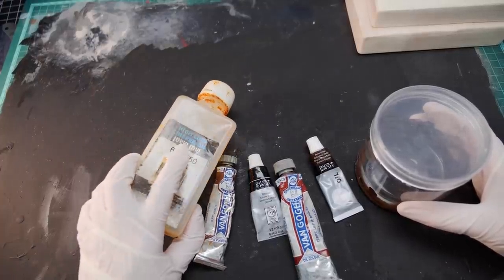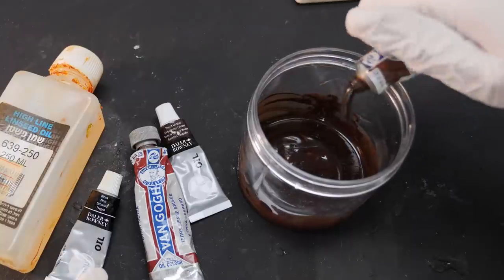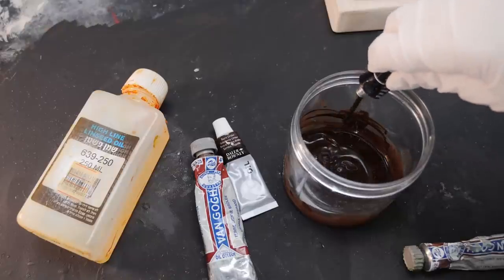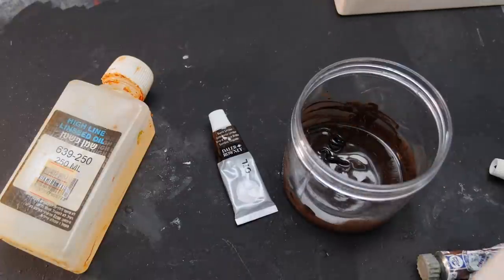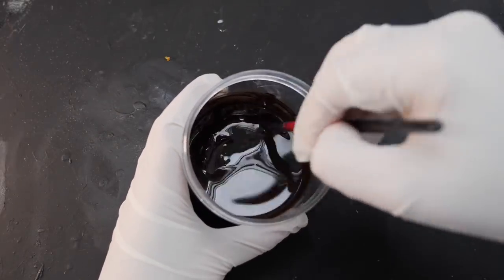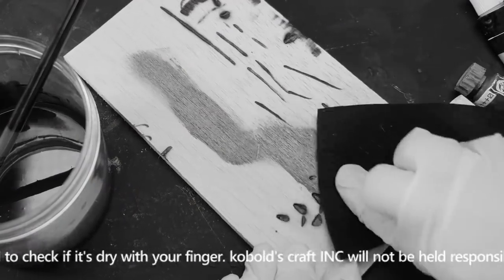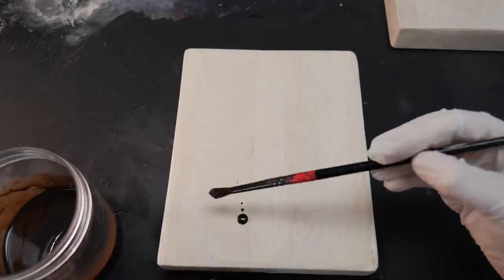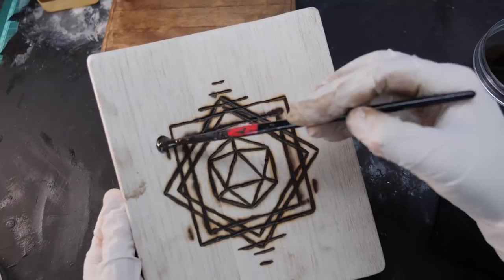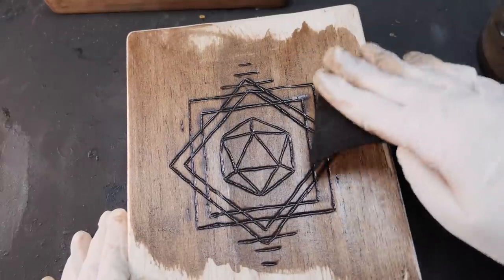If you already have wood stain or don't have anything stopping you from going to the store, the next step may be irrelevant to you. Because I don't have any wood stain, I resorted to mixing oil paints with linseed oil to thin them down and make my own stain. Fair warning: this method results in a long drying time causing headache, agitation, and the constant need to check if it's dry with your finger. When applying the stain, make sure to wipe off any excess with a piece of cloth because you don't want it pooling on the wood — it'll be a sticky hot mess.